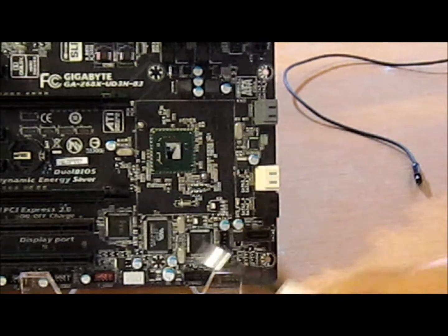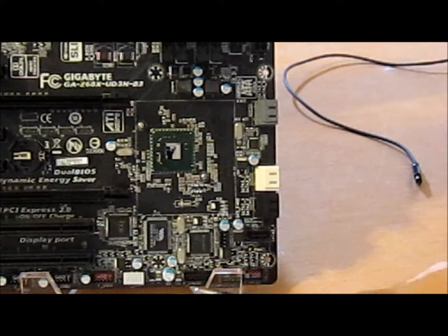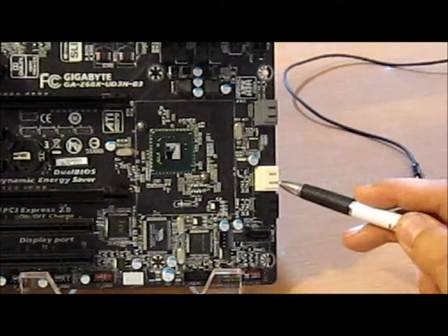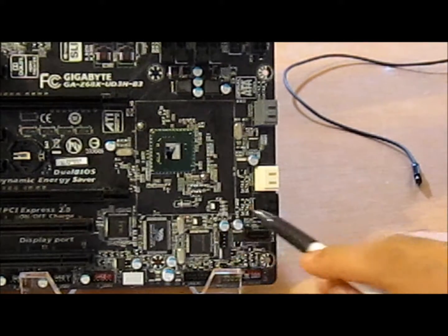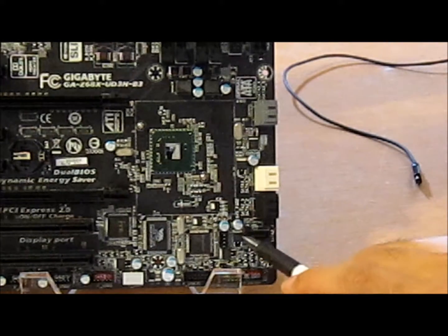Okay, so we go to the PCH. Remember, there's no TRIM on Marvell, because the TRIM command does not pass through to the Marvell controller. It only passes to the Intel controller, natively. These white ones are SATA 6 Gb/s from Intel. You want to RAID, you do it on here. It's your first port of choice for any SSD. These black ones, 3 of them, 1 straight, 2 angled, are SATA 3 Gb/s.